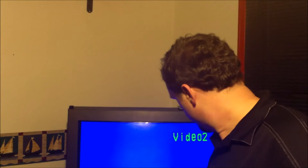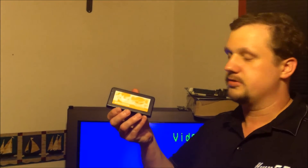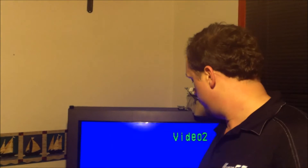So what I've done is created this disc that works with a super bios cart, which I have right here. This cart has been converted to DarkSoft super bios, and the CD works with that. The cartridge will allow you to write all that data back to the motherboard so you can use your working no CD card. All the data on the CD is the original Capcom code for the games - we're just tricking the motherboard into writing that data back using the super bios cart.